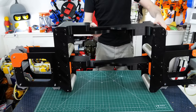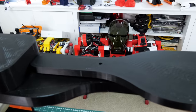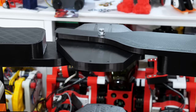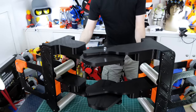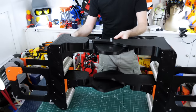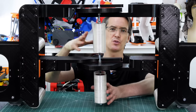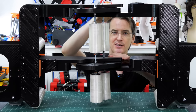I've got both hinge pieces installed so basically it's going to sit like that with a pivot in the middle — this thing really is massive, it's around a metre and a half long. This is the pivot point but we need some rollers which we're going to wrap the track around. We've got these extra floating sections which are actually going to hold those rollers, and they fit independently of the two sides — there's one at the top and one in the middle, and these rotate independently. That means we can put the rollers either side and we still get a pivot point in between the rollers in the middle where the whole thing folds. If it's just one roller in the middle the track could only go one side, which is why there are two rollers fitted onto these independently rotating things.